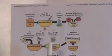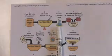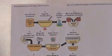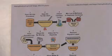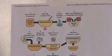You're then going to do something called a titration. A titration is nothing more than finding out how acidic the oil is, because we're going to need extra lye to counteract any acid that's in there if we want the biodiesel to be made. We're going to figure out how much lye we need.